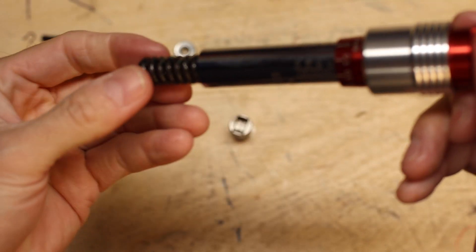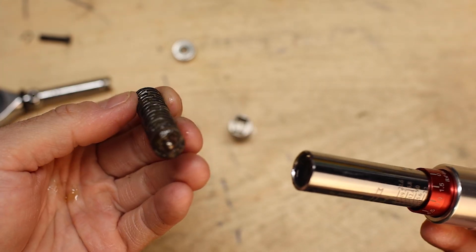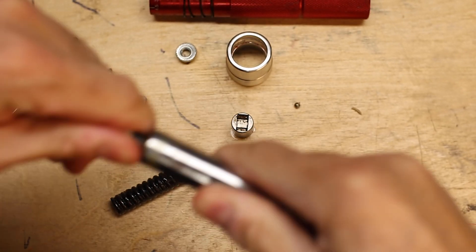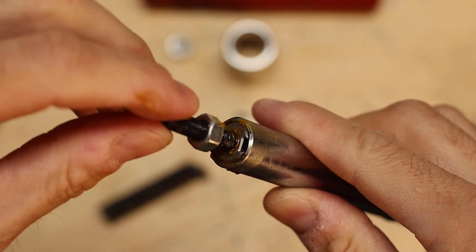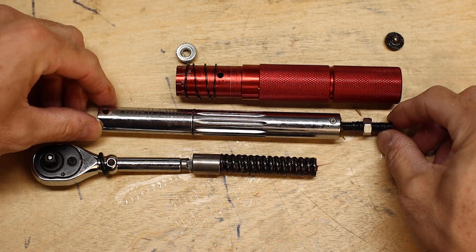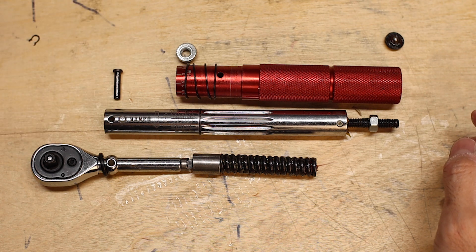The thing actually applying force to the clutch is the spring, which is buried down inside of the main sleeve. It's actually much stiffer than I would have imagined, but it's here nonetheless. At the other end of the body you can see where you'd make the adjustments. This nut is where you'd make the calibration adjustments, but the whole threaded shaft can also rotate — and that's what you're actually turning when you set the torque on the wrench by turning the handle to match the desired torque printed on the scale. This is what increases or decreases the compressive force on the spring, and thereby increases the required torque applied by the user to slip the clutch, or in other words to click the wrench and achieve the desired torque value.